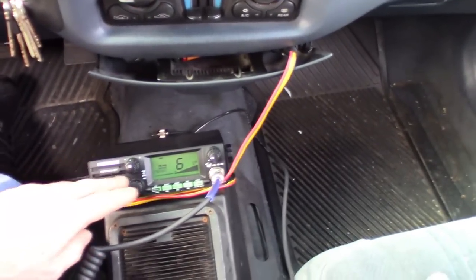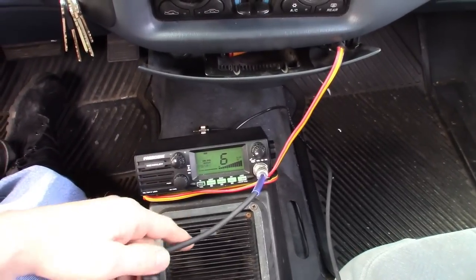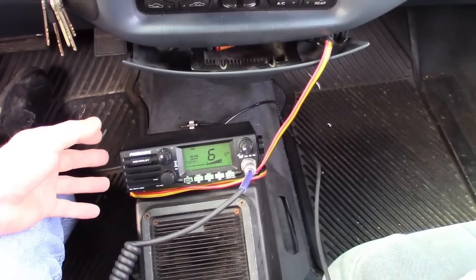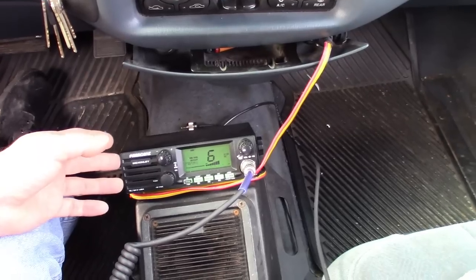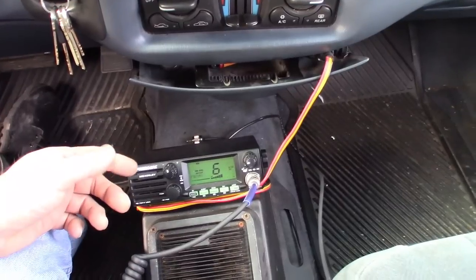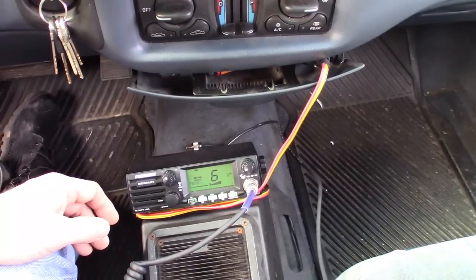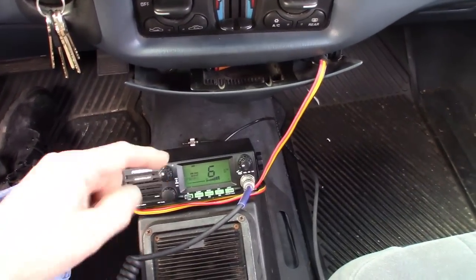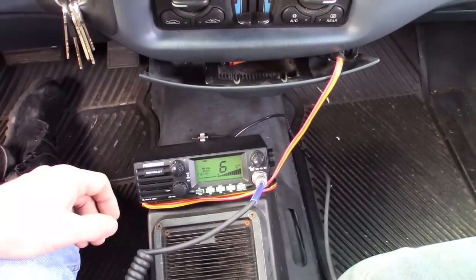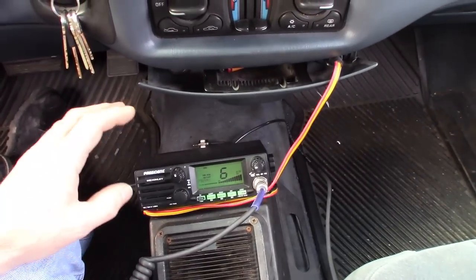That's one thing I always find so hilarious. These people have these junk radios running these extremely huge amplifiers. Somewhere between 30 to 80% of their power is not even on channel. It's all in the adjacent channels. I mean, if I hooked up a spectrum analyzer and just stuck an antenna out the window right now, I'd be able to probably read that guy's second, third, fourth, and fifth harmonics. Most of their power is not on channel. That's what I always say. These people with these splatterbox radios look great on a watt meter, sounds like hell on air.